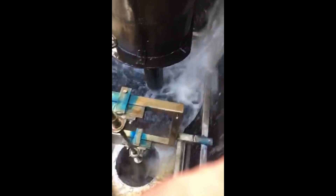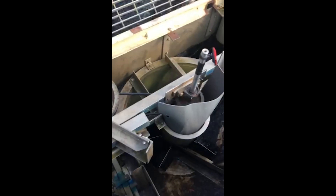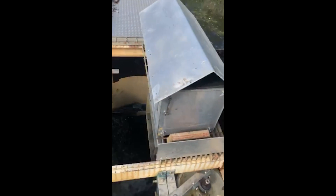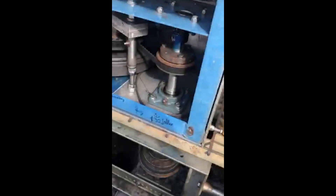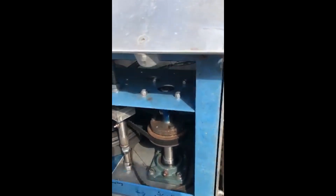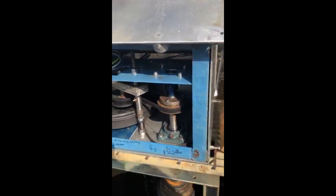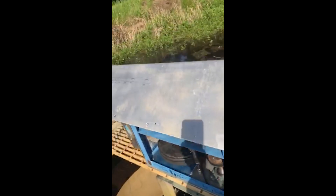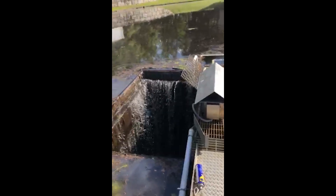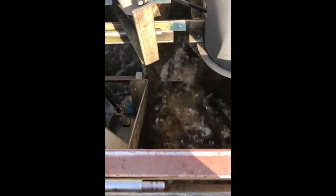This is his video that he sent me when he first had a hydro system set up. It's about six square miles of drainage in Georgia, and this is actually the top of a five-acre pond. Right now he had two stacked vortex turbines that weren't producing as much as he wanted, and there's a washing machine motor that he converted over to belt-drive generator use. He wanted something that could do a lot better with what he has. This is a medium-low flow rate for his system.